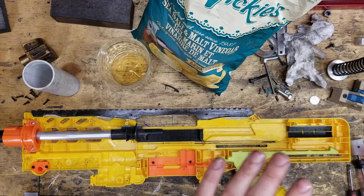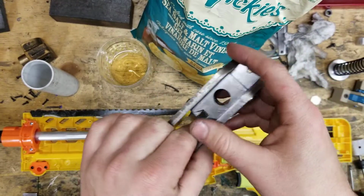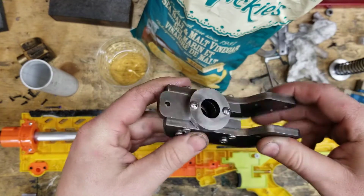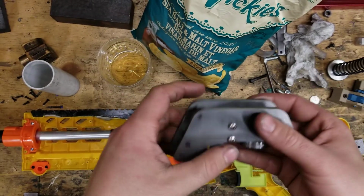But I've been really enjoying the Caliburn build, doing it this way, having all the shitty work, like the bandsaw work, done by a laser. 90% of the holes are done by a laser, and then all I have to do is drill and set some holes up on the mill and drill and tap a few holes. And I actually enjoy those kinds of setups on the mill.